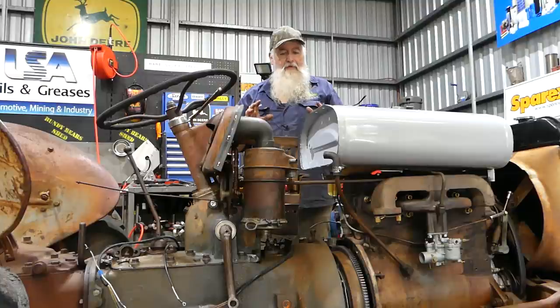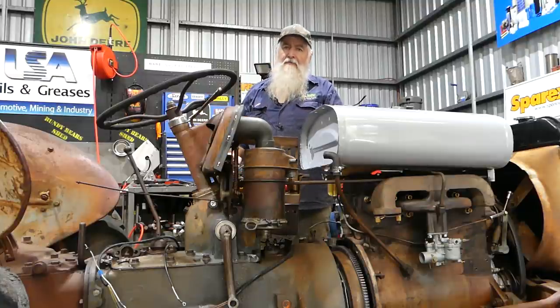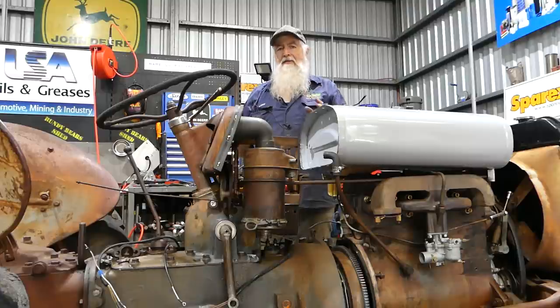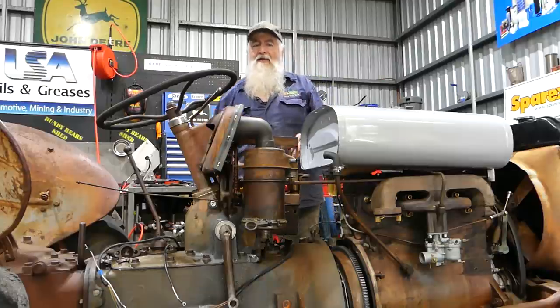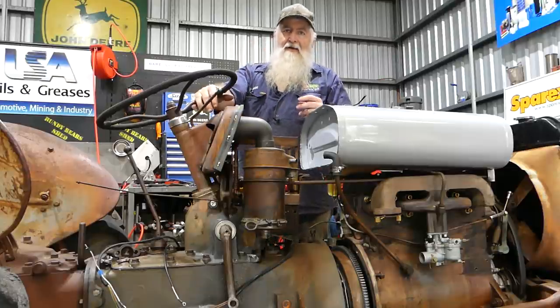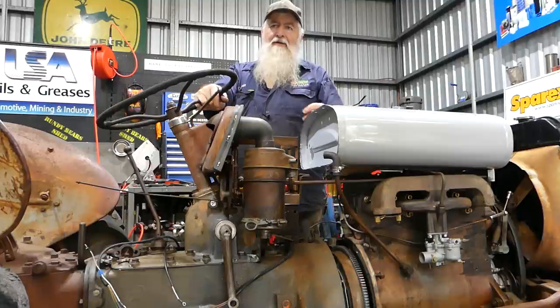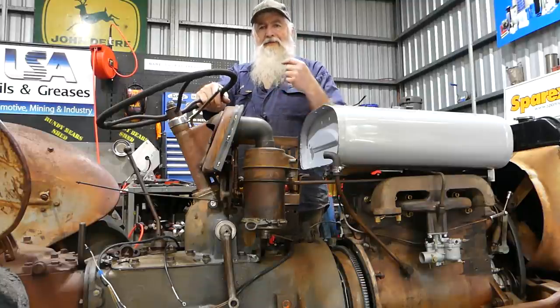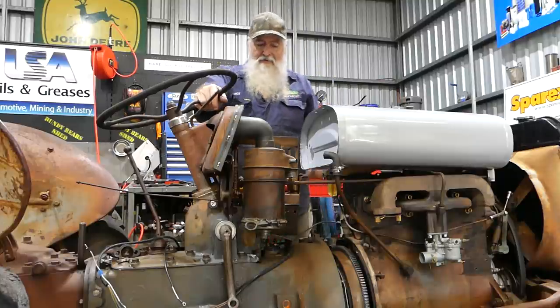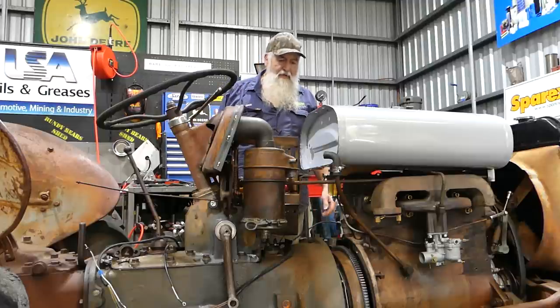From my history of buying these gaskets - you can buy bell housing gaskets - but the ones I've had in the past are that thin and flimsy that if you can get one on there without buggering it up, you're a better man than me. They're dry and when you try and fold them out where the bolt goes through, they split. This is the way I've chosen to do it.